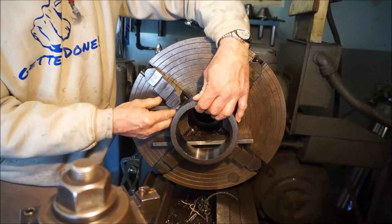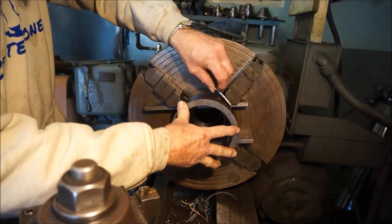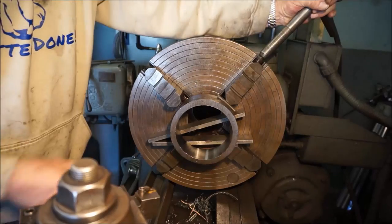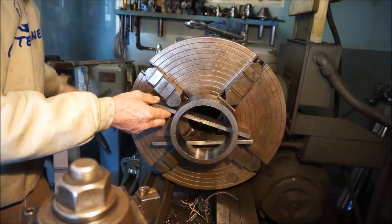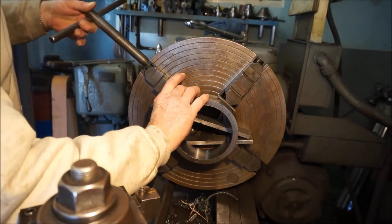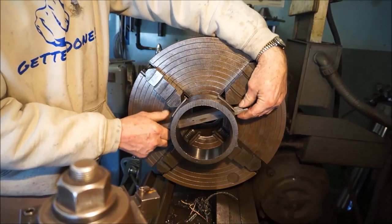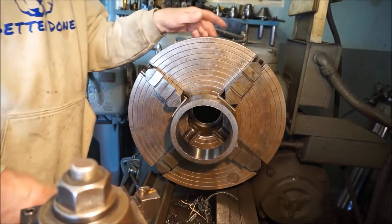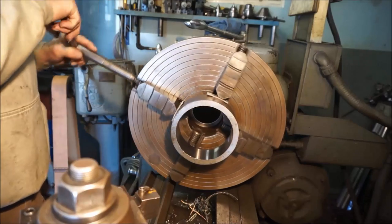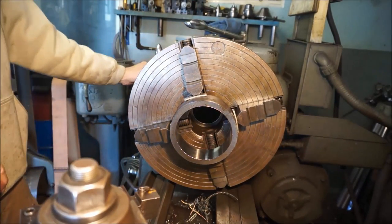Then I put the secondary parallel, and I'm holding pressure against it right now. So now I'm going to try to slip one of these in here and give it a little tension. And of course, as long as I make sure that this is still in over here, we can add this one. Okay, I can slide the parallels from there to there. They feel pretty close to being the same feel, top to bottom. Just give it a little cinch. All right, let's see what we got here.